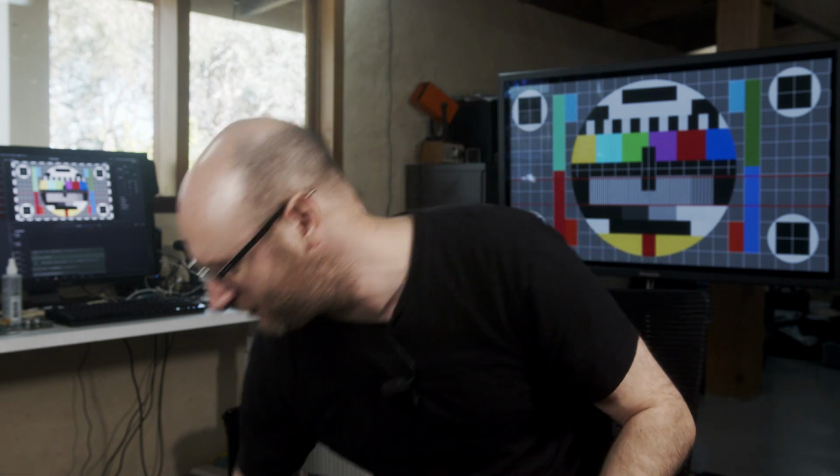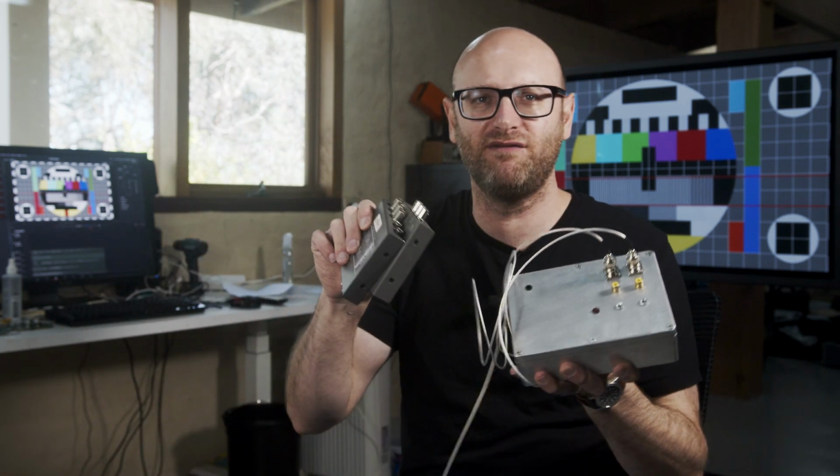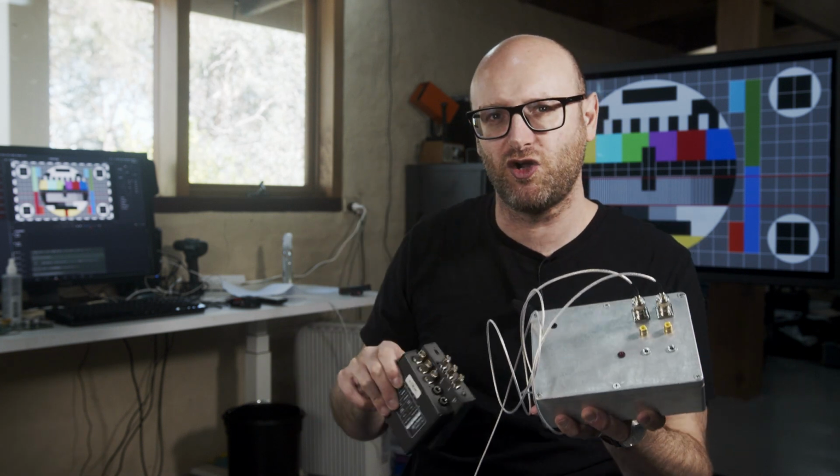Turns out he's primarily sort of I guess an audio engineer or electronics engineer who focuses on the audio domain. He does a lot of work with FPGAs and RF, doing sort of multi-channel distribution of high quality audio. And so this is a step up in bandwidth for him, but he has the skills to do a bunch of things that I can't do. And we started chatting about sort of taking the combination of these two devices and turning it into one. So you could have a box that takes HDMI in, spits out a sync separated component, again in air quotes, because we're going to violate the component standard in a couple of ways, analog signal that then lets you interface into modular video gear.